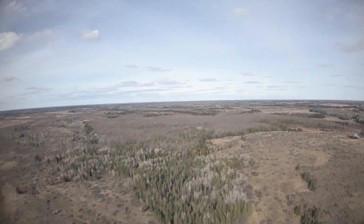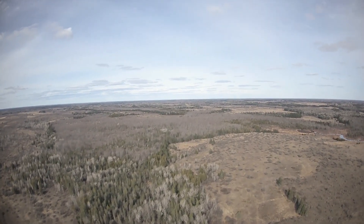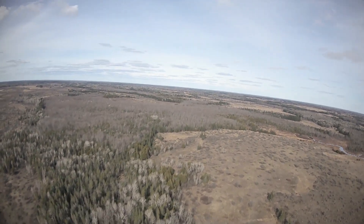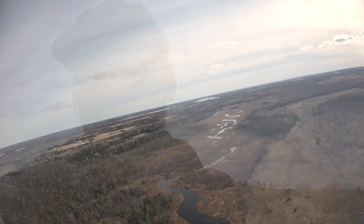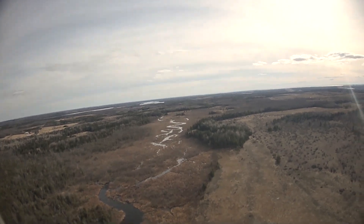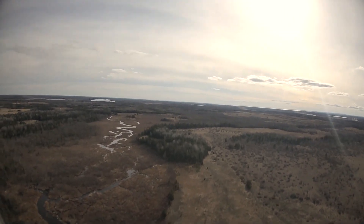It's about the same as my LiPo cells that are about 900 milliamp hours, and at least with those cells I don't have to freak out about them losing voltage towards the end of the flight. So I'm probably going to stick with 900 milliamp hour LiPos for most of my flights, and only really bust out the lithium-ion cells if I really need it. It's a bit of a bummer — I did spend a bit of money on this experiment. Would I recommend these? Probably not. For doing mid-range flights and that sort of thing, just stick with the LiPos.